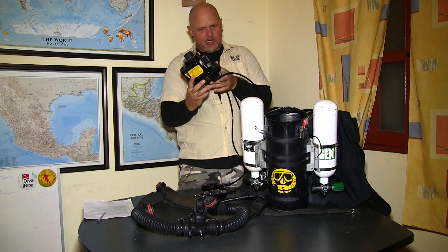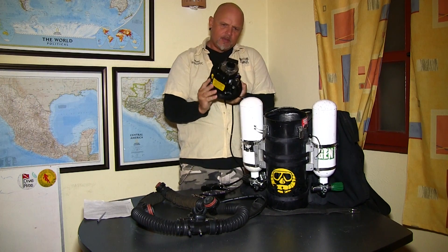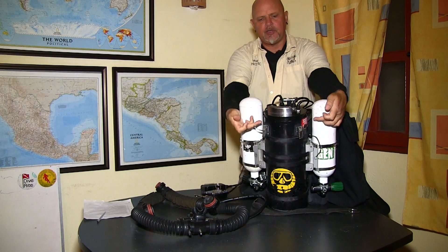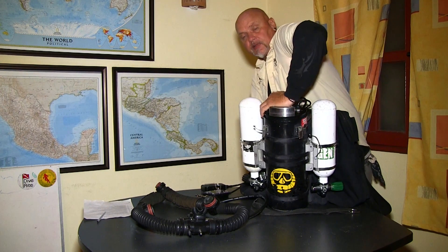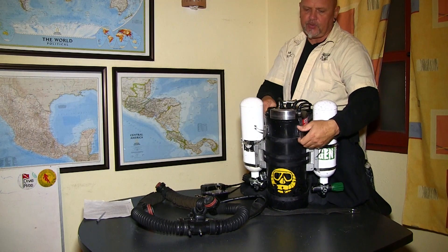I'm going to look against the light and make sure there is no hair over the O-rings — that's good. Setting it on, straight down, make sure there is no cable coming out here. The cable comes out on the side and if you push the head down it's going to pinch the cables. So in the middle of it, give it a good push down — one, two — I felt both O-rings going in.